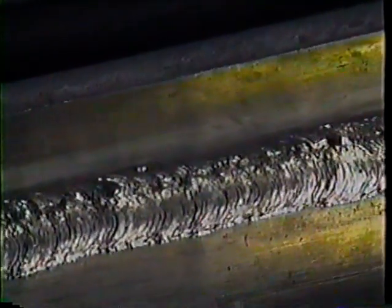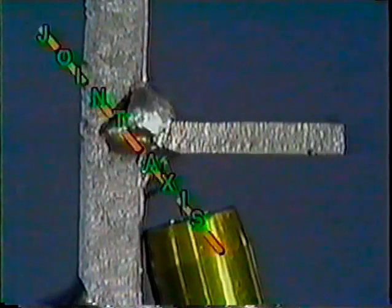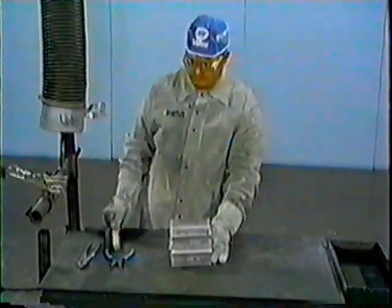When welding string fillets, it is important to ensure that the toes of each bead blend in gradually and smoothly into the surrounding beads and/or base metal. Now, this third bead will be laid across the top toe of the first bead, as shown here. Notice that the angle of the wire is different than that of the first and second bead. The wire is now pointed above the axis. Ensure that the bottom toe of this puddle fuses into the second bead and the top fuses into the upper base metal. Remember, what you see molten is what you get solidified. The first bead has been covered up by second and third interlocking beads.